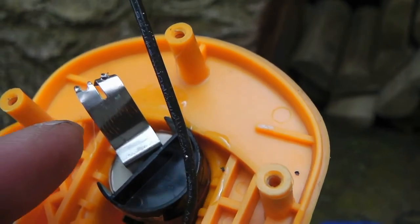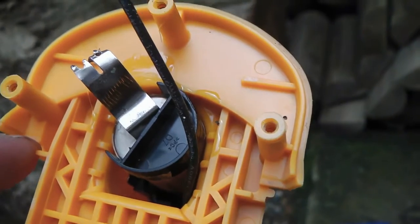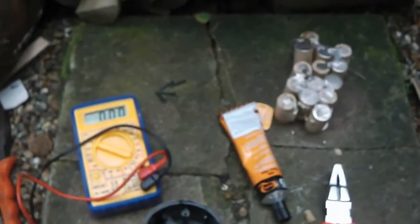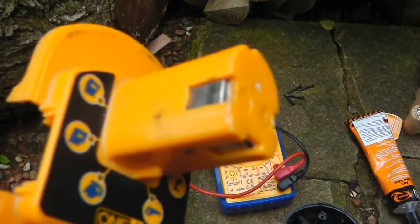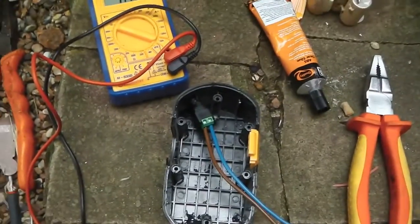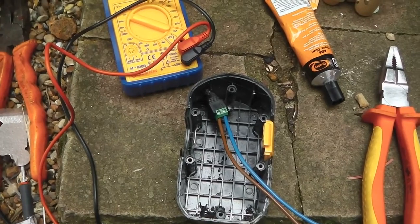There's a tag — I think it's the positive tag — which went straight onto a battery. There were a couple of other wires in there which went to some sort of temperature sensor, and one on the front of the battery which I guess is some sort of voltage sensor, or allows the charger to switch off when it reaches the correct voltage. I'm going to warm up the soldering iron, solder this all together, and button it up.